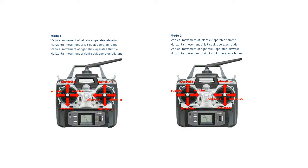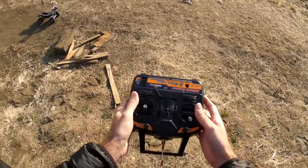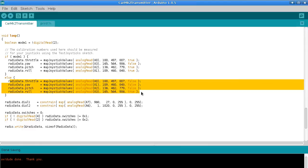The way I do this: you turn the transmitter upside down so that the stick that has no return-to-center spring is going to be on one side or the other, depending on which mode you want to use. This is the code — it's pretty simple. I'm taking a digital read on pin 2, which is one of the switches on my transmitter box, and depending on whether that's switched off or on, we're going to be Mode 1 or Mode 2.